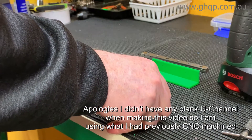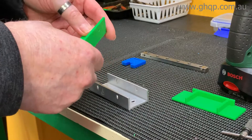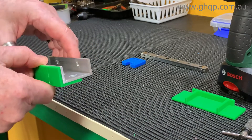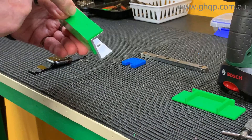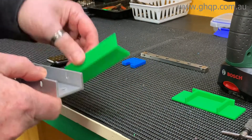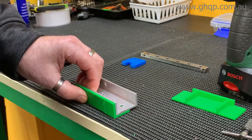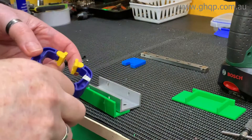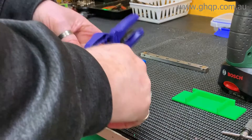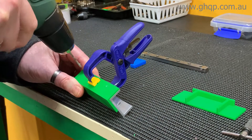So the next part of the process: once you've got those done, this is the piece for the side holes. What you do is you sit the U-channel on top of that — you know you've got it the right way around because the height will match — and again put a bit of tape on it. I've also put a little mark where the center is, so if your U-channel is not exactly 100 millimeters you can mark the center point and line this up to it. You could even take a couple of little clamps to hold it in position.